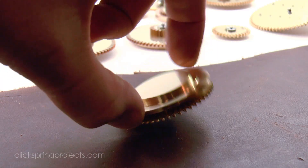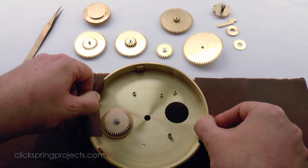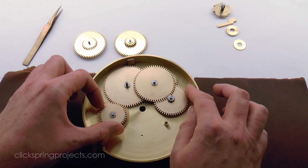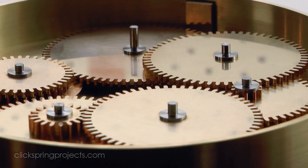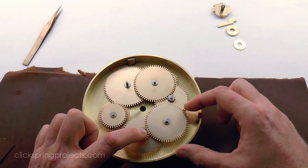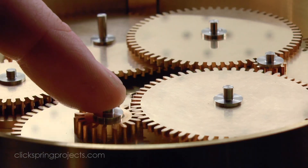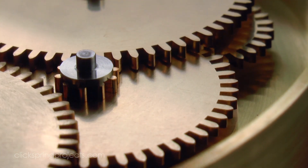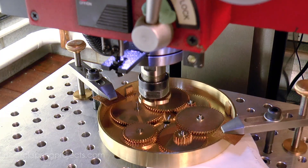Let's have a look at what we've got. The bracket supports will come later in the build, but even without them the assemblies sit quite upright and true in their bearings. Overall, I'd say that the gear interaction is quite good — there's no binding, and I'm not seeing any excessive backlash. The lunar phase assembly is moving laterally much more than it will when given its upper support later, but even with that, the train moves freely with good clearances throughout. The input assembly can also be assessed at this time, by identifying the input arbor position as before and then carefully lowering the assembly into position.